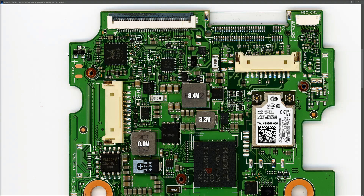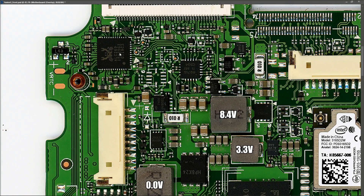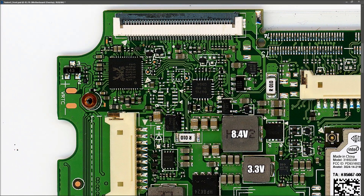So here's where we are: we found a blown MOSFET, replaced it, and brought the main power rail back online — however we now have this ALC269 audio codec IC heating up, and I'm not sure if I have a spare. It seems like this needs to be replaced as well. Please post in the comments where you think we should go next, and I'll pick it up again next week.